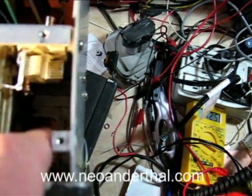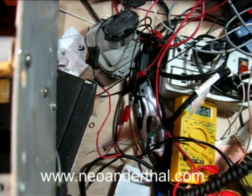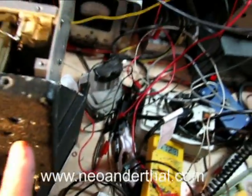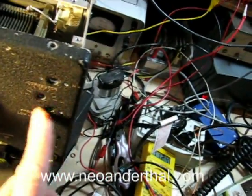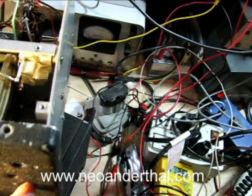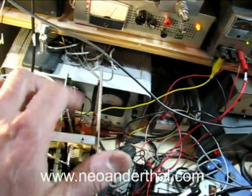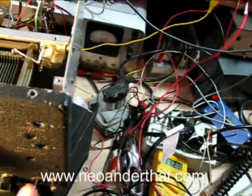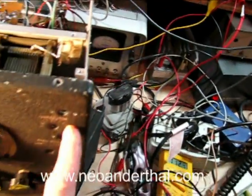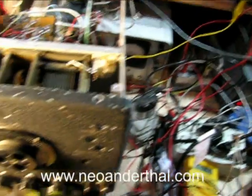There is some extra area back here that allows you to actually add some more air variables for trim on a VFO, or to also get access for other pots and whatnot. Usually there's a couple of shafts that run through here that drive air variables on the backside of this back wall, but if you pull all that out, then you can access some extra space on the front of the chassis to use for either other switches or pots.